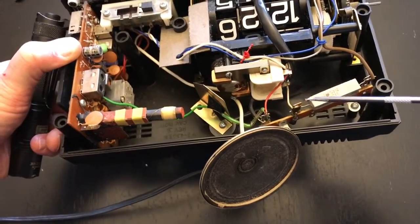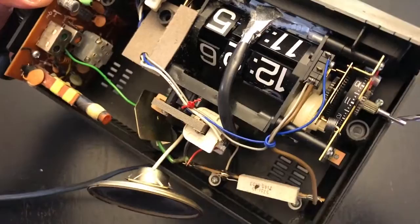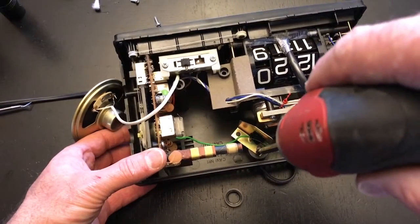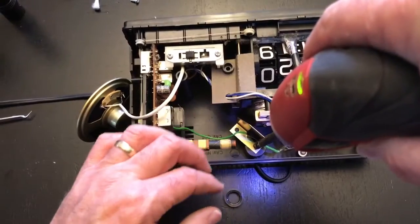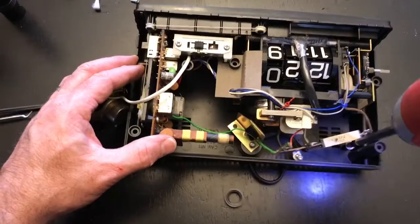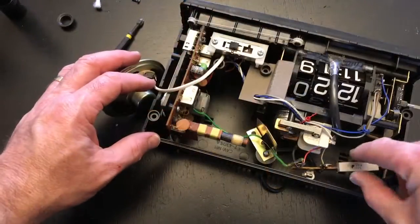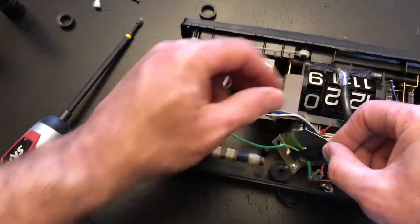This right here is hot — that's the main electric coming in at 110–120 volts and that could kill you. There's a screw deep down in there and one on the left side. Make sure you're not plugged in — this is one of the most dangerous clocks I've worked on because it's straight-up power right there. Just start removing all the visible screws.